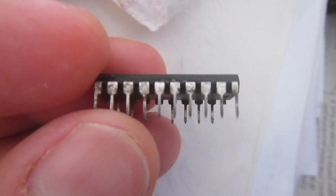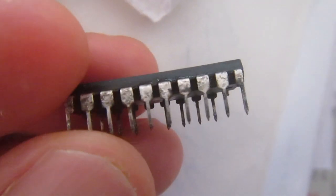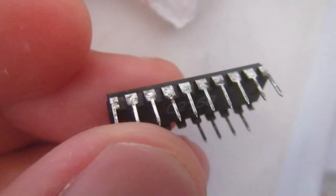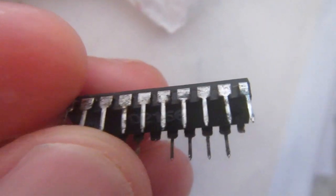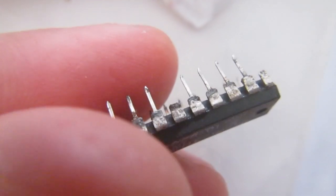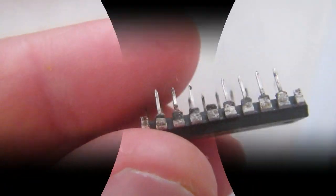This is the result of washing the chip — there is still quite some oxide, but at this point I will apply flux and tin every pin on both sides, then find some replacement pins for the missing ones.